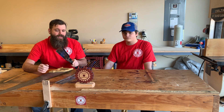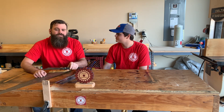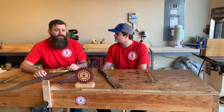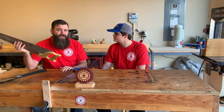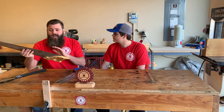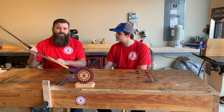I love the pull saw personally because the muscles I use on a pull are typically stronger than those on a push. Also, I'm less worried about injury on a pull saw — on a push I might have a hand in the way. So I would also rank this one first, this one second, this one third — unless I'm going through a ton of two-by-fours and big boards. For heavy construction material where cuts don't need to be precise, I might use the bigger-tooth western style saw — though honestly I'd probably use a power saw. For miter cuts, the miter back saw's box is really nice. If I had to choose two saws, it would be the Japanese pull saw and the miter back saw.